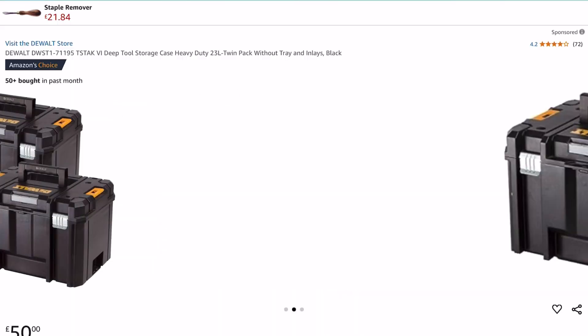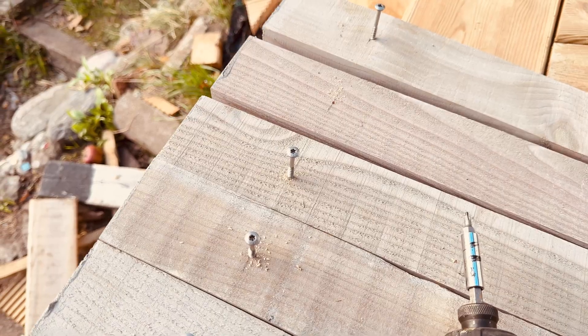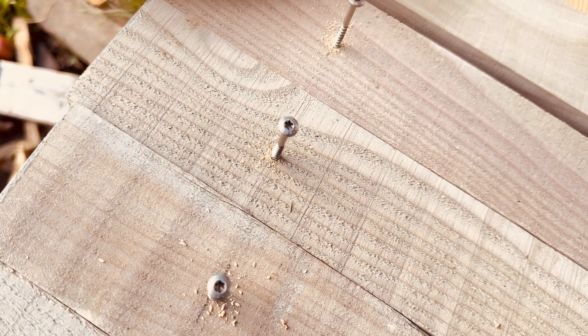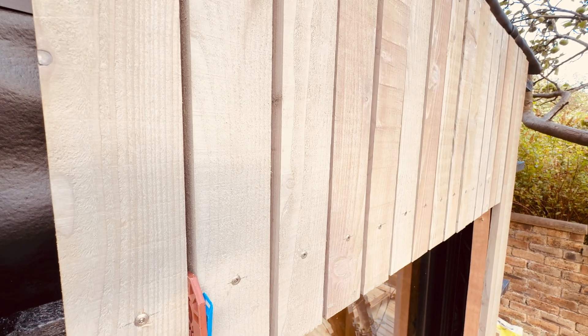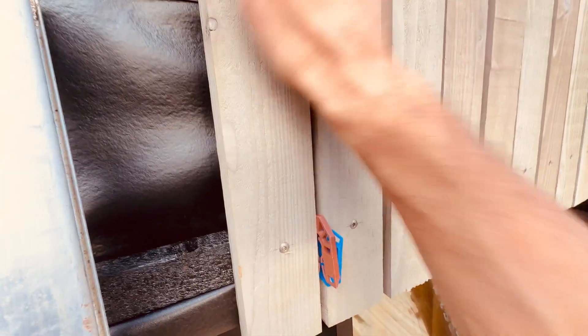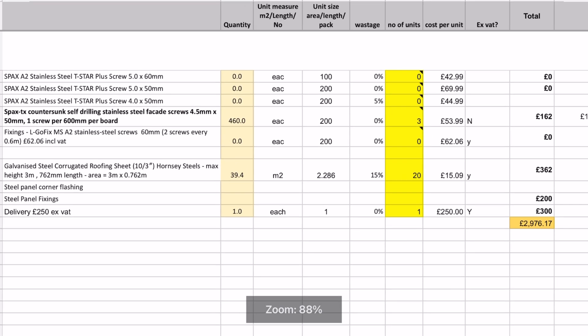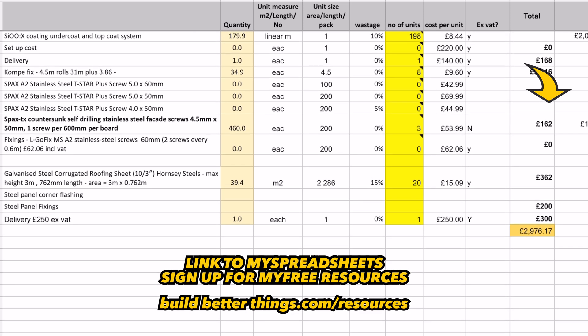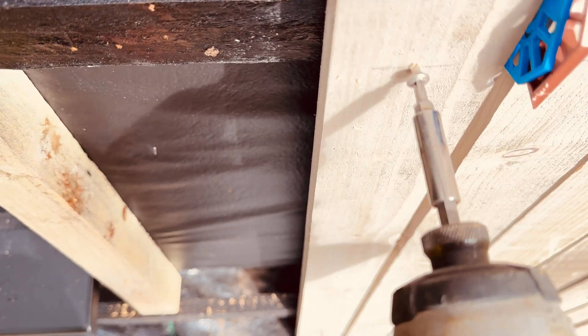If I can't get all the tools I need in two boxes, I'll use hand tools. I'll cut and treat the edges, then use stainless steel screws piloted in at set points to match the batten positions, ensuring fixings look neat and coordinated on the elevation. For wider boards — say 145mm with a 153mm cover — I'd use two screws at fixing points to prevent cupping, but a single fixing is fine for these narrower boards. You can use a nail gun with stainless steel ring shanks, but then you need two fixings per board and it's impossible to get it neat. I drive the fixings in so they just grip at the surface — I don't want to pierce the silver finish and risk uneven colour around the fixings.